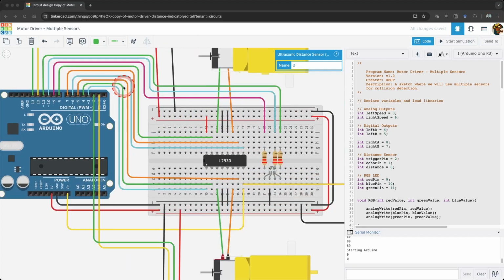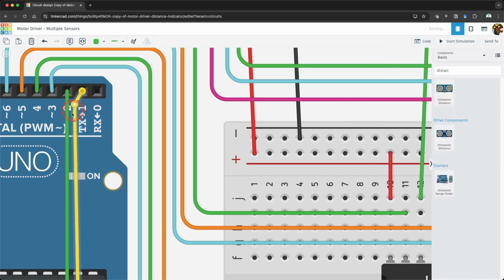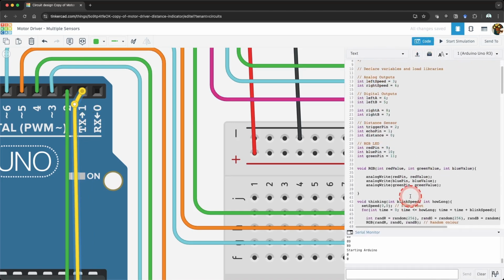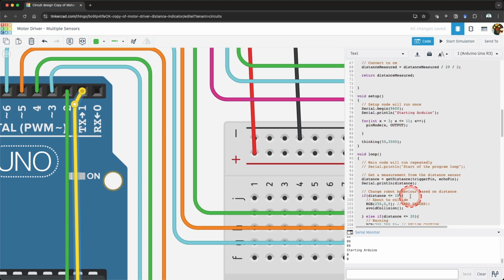So why is this happening? If you look at pin 0 and 1 on the Arduino, you will notice an RX and TX. These pins are used to receive (RX) and transmit (TX) data using the serial port. In our setup function, when we write Serial.begin, this uses the pins for serial transmission and enables us to debug our code. If we don't use the serial monitor, then we can use these pins.